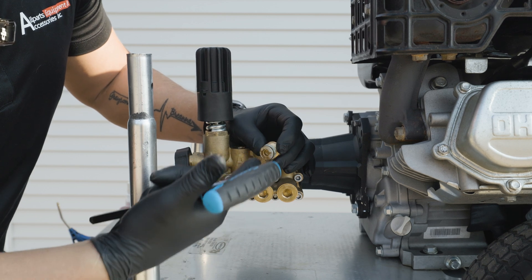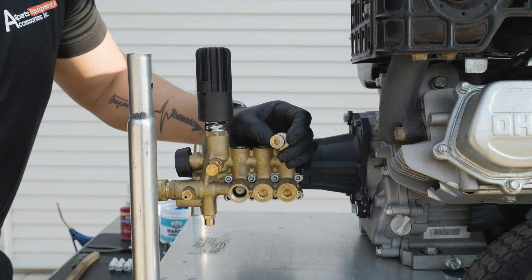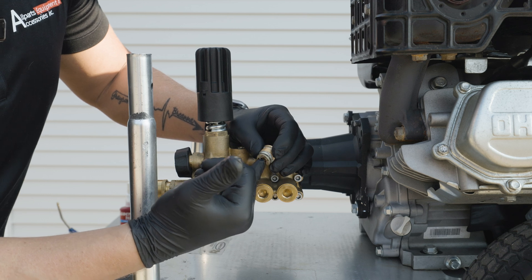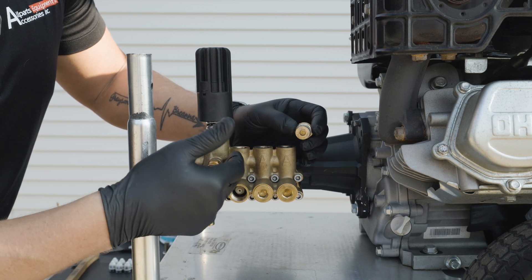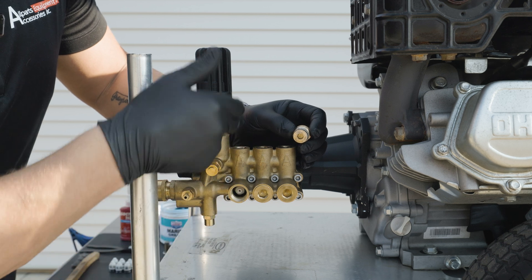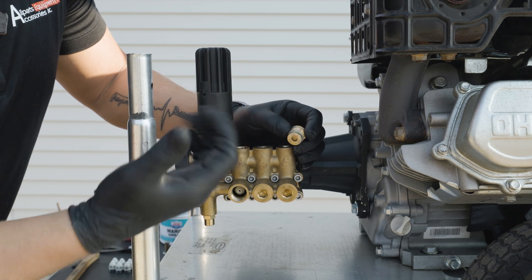The reason is so that the valve cage on the bottom, if you notice, will be facing outward. The nipple on the cage fits inside the lower cap, whereas on the top caps the cage is facing downward and inward, so the caps press down on the base and the seat of the cap.